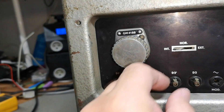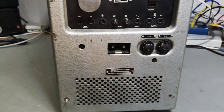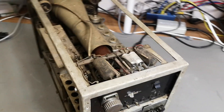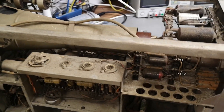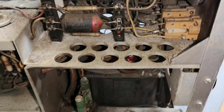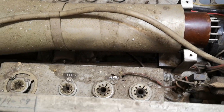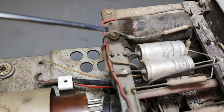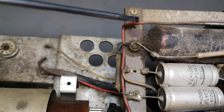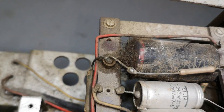Let's try and look inside before we power this up. Oh no - this is exactly what sometimes happens. Somebody stole all the tubes! It is completely ripped - look at that. There's no way we can power this up, but at least we can see inside. There's a terrible smell. Look at something funny - this is definitely high voltage damage. You can see the dust traces here - tracks of dirt definitely due to high voltage.